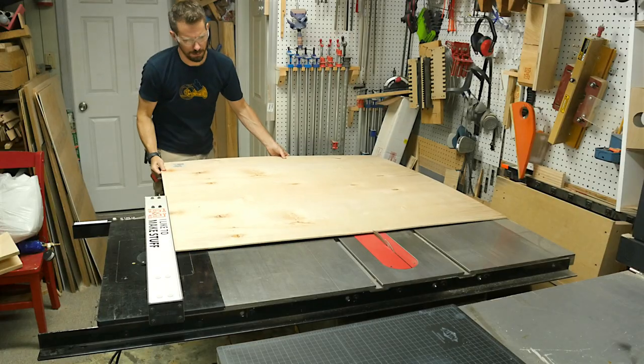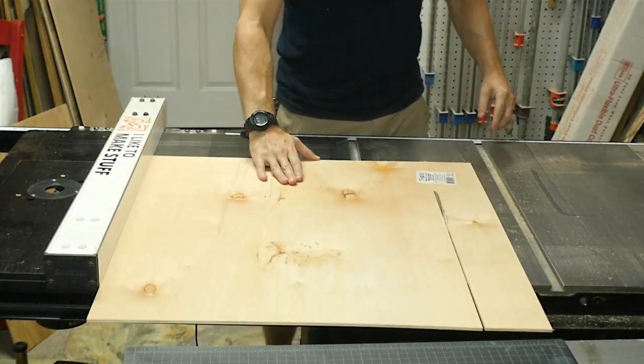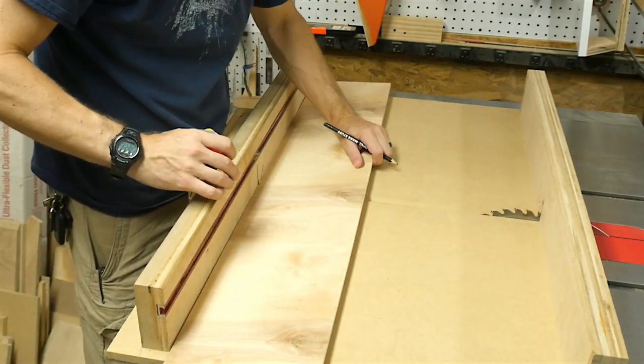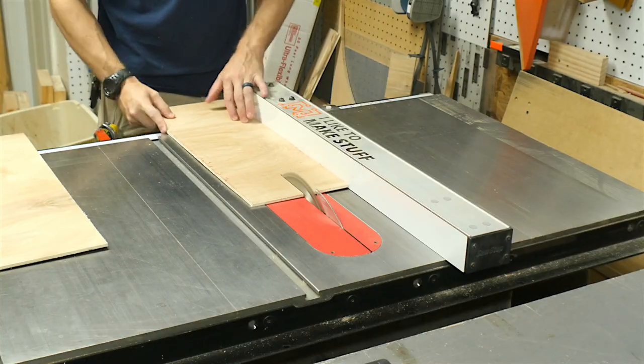I made sure that the filter fit before moving on. I cut down some more pieces of 1/8 inch plywood — also scrap that I had — to use for the top and the bottom panels, and I cut down a couple of pieces with a crosscut sled to act as flaps. I cut down two pieces that were the same width and then ripped them in half on the table saw.